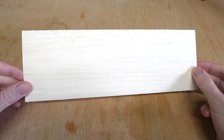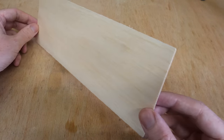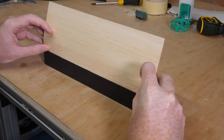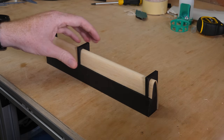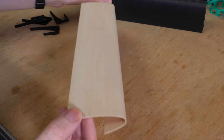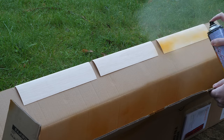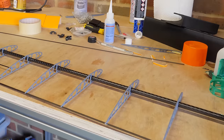To fix the issues caused by the covering film, I decided to use a thin sheet of balsa wood to reinforce the leading edge. This stuff bends really easily and if you take it outside in the British weather, it'll bend even easier — so much so that I could bend it round a 3D printed mould of the wing and pin it in place until it dries. Once dry, it holds the curved shape of the leading edge, and I can print some new ribs with a small step where the balsa will mount to. I then gave the wood a few coats of bright orange paint to make it look nice, which gave me some extra time to build a new wing structure.